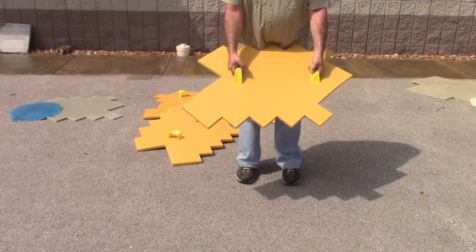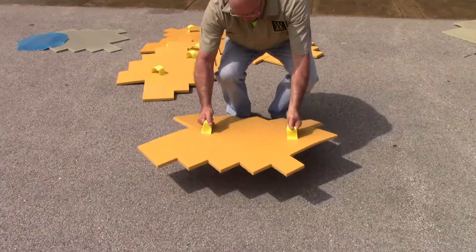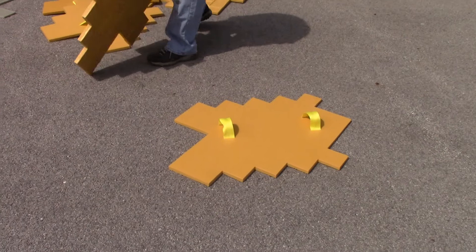Standard herringbone design — it's a down and back stamp, so it's very simple to use. You're going to start on the edge of your stamp patio. You're going to set one down with the corners lining up at the edge of your patio. Of course, you'll use your floppy to touch up those tiny little notches there, but then you'll just continue on with your stamping.